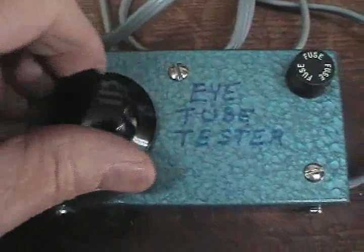Now this is not the same tube — this is still in the radio. I took it out of this radio because it was easier to get out. This one's real weak, but I'm going to show you how I test these things. I built this tester specifically for testing eye tubes. This particular eye tube is extremely weak, but you can see the pie wedge at the bottom as I turn the bias control on my tester — you see how it's opening and closing.